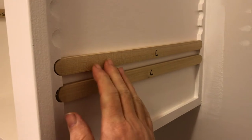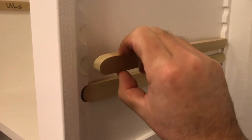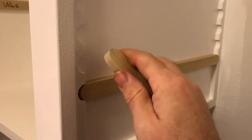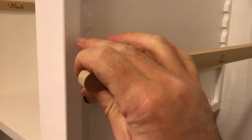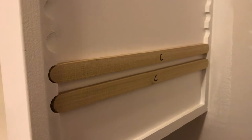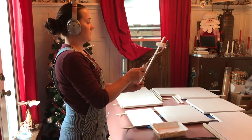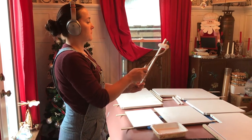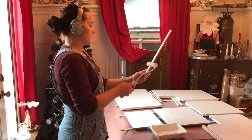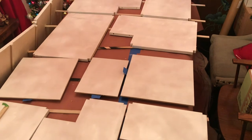When you go to paint the shelves, only paint the side that faces out and the bottom — don't paint the top, the back, or the rounded edges. Wax those instead, because you don't want paint sticking to paint. My wife helped out painting all the shelves during her Christmas break — first coat of primer is on.